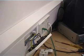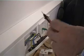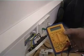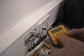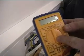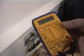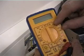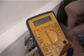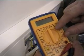But the best way to do that is probably by using a digital multimeter, and it is definitely the most accurate way of testing voltage. What we'll do is set the selector — if you can see that on the video — round until you get to voltage. That little symbol, like a wavy line, means AC voltage, so it's in the range of about 200 volts.